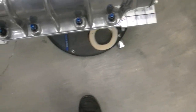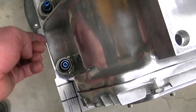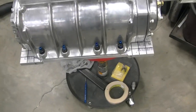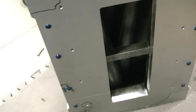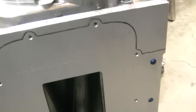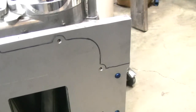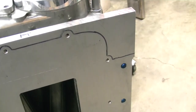I've got all the studs in and everything fits. I did start profiling the side of this a little bit while I had it chucked up in the mill to get some straight edges on it. Blowers are cast, so they're not exactly perfectly straight, but it's close enough. I cut the bottom of it out — there it is, all cut out. As you can see, I used a 5/8 plate and the studs just stick out of here. If you go with a half inch, the studs are going to stick out a little more. I've marked where the intake is going to be so I can cut around that and profile this thing so it doesn't look like a square hunk of aluminum bolted on a Holley Hi-Ram.